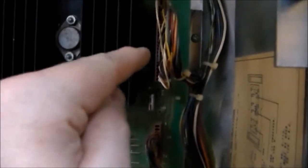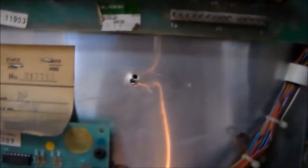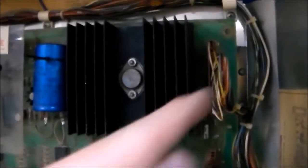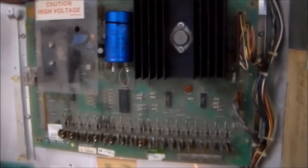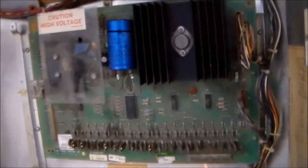There's one wire that goes to the back, but anyway, if you tie test point 3 to test point 1, if you put a jumper wire between 1 and 3, that makes a connection a little bit better. There's one wire that only goes to one of those. So there's just a couple little minor mods like that that people do on these. You can find all that archived online.